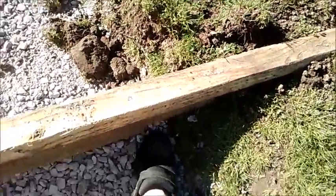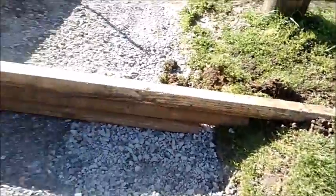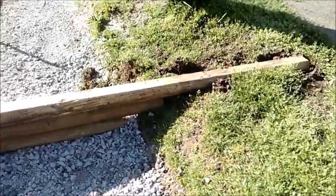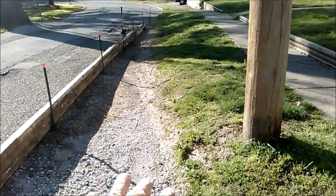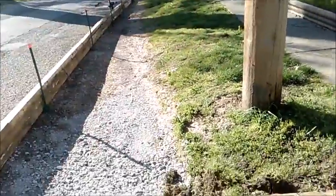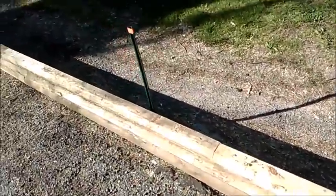See, straight below here — I'm out towards the end now — rocks go up in here and dirt right there, because that's going to allow water to kind of pass around and go in underneath there. I'm going to put some sand there that'll help with the water as well, and then it can run on out without washing out the dirt we're going to put in here.